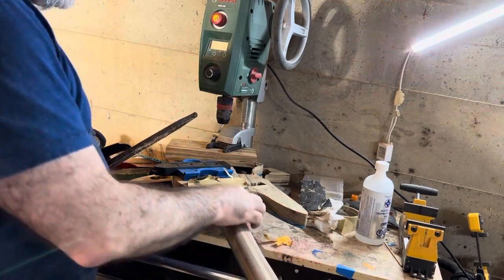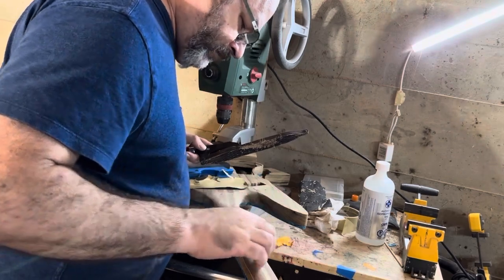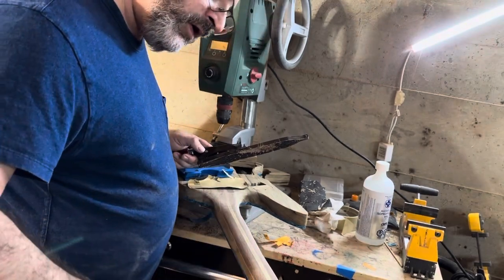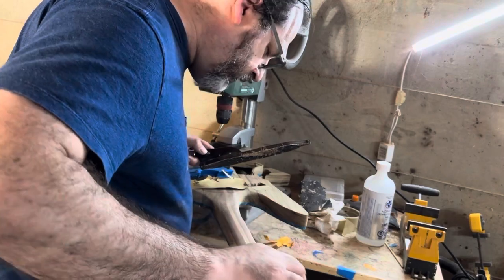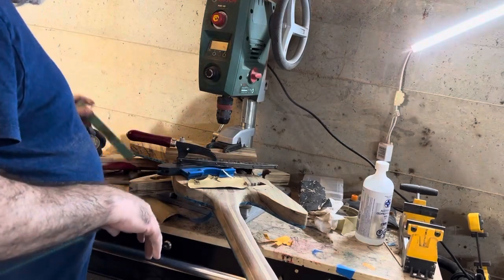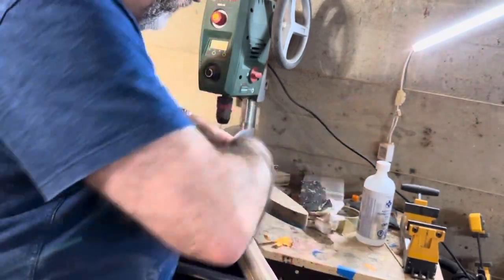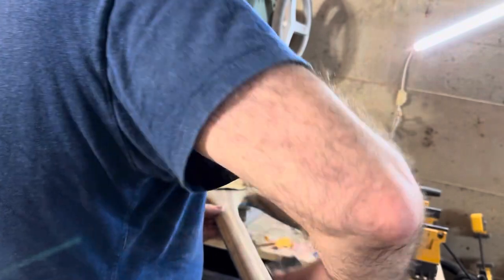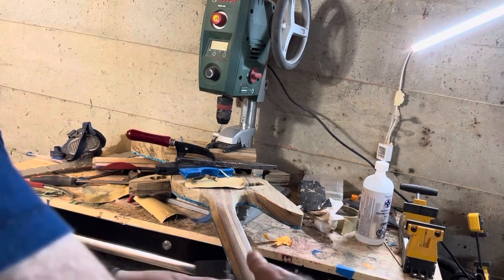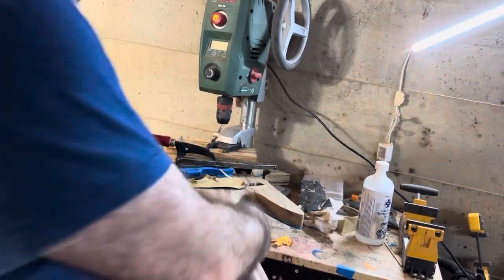When it comes to carving the bottom, as long as you align things correctly, you can see that this particular line of veneer and that particular line of veneer need to align pretty much straight, and as a result, you get a straight neck. So, although we finish it with the help of one of these things, to make sure our neck is tidy on either side. And at this point, we're just taking off that little bit of additional edge between the binding and the wood.